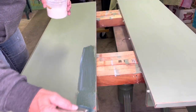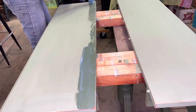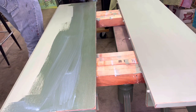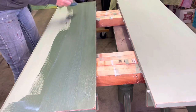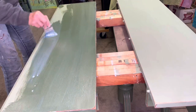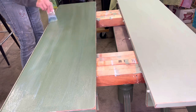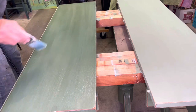The top of the table is going to get a lot of wear, so Big Top is very durable and I usually put three coats on tops of tables. I go every which way with my brush as I'm putting it on while the Big Top is still wet. Then I take my brush and go one solid stroke all the way across, continuing until the entire top surface is completely coated. Then I go back through while it's still wet — you can't do this when it starts to dry so you have to work quickly — just one solid stroke, always going the same way.